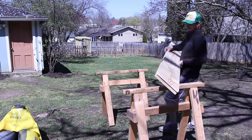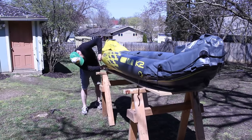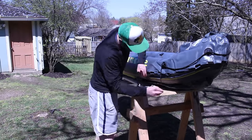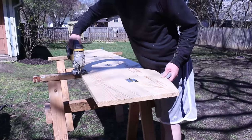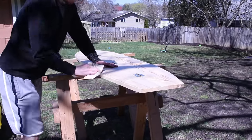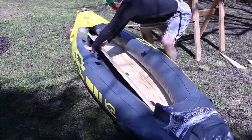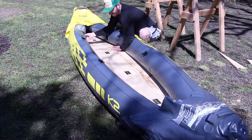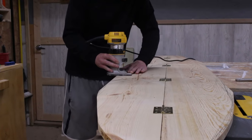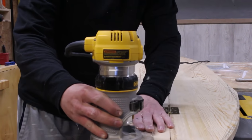I placed the inflated kayak on top of my floorboard so I could shape the floor to fit inside the kayak. I used the bottom of the kayak to get a rough outline for my floorboards, and I could then cut out the shape with a jigsaw. I made sure to sand the edges of the boards before test fitting the floor inside the kayak. Once I got the floor to the right size, I used my router with a roundover bit to round off all the edges. This part is optional — using sandpaper on all the edges would work just fine.